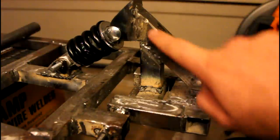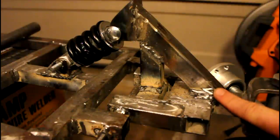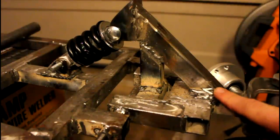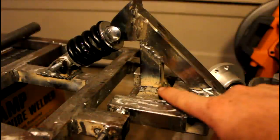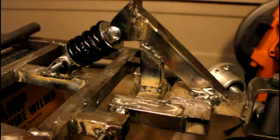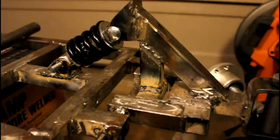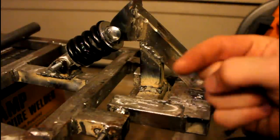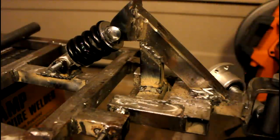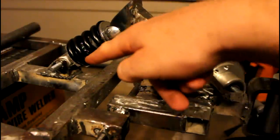Here's a closer look. This is what I was left with just before I left for vacation — just this piece coming out of the suspension arm. When I came back, I cut this truss piece and welded it to both ends on the suspension arm, and that's going to really strengthen this piece. All the load is going to be going this way when the suspension arm pivots and compresses the shock.